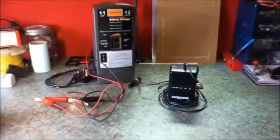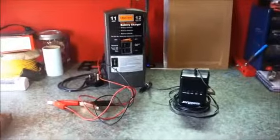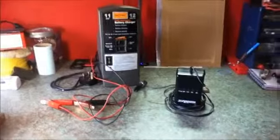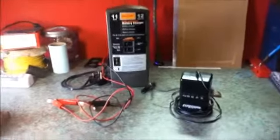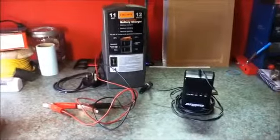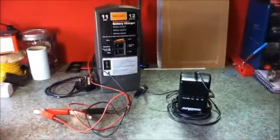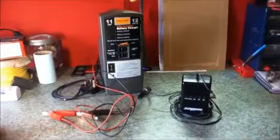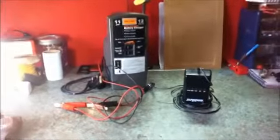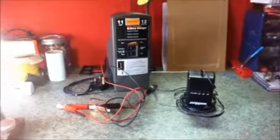Okay, in this section I am going to talk about battery chargers. I mentioned earlier in other parts of the video that if your battery is run down until the low battery light comes on your charge controller, your battery is seriously considered to be flat. At this point, it is a wise idea to charge your battery immediately so that it won't be left standing in a discharge condition getting sulfated up. If this happens, your battery will be hard or nigh impossible to recharge.